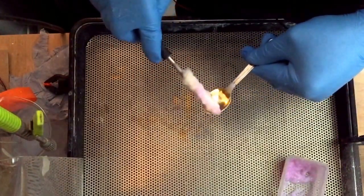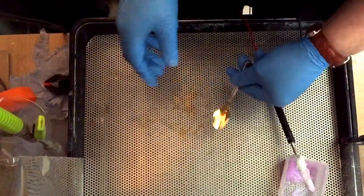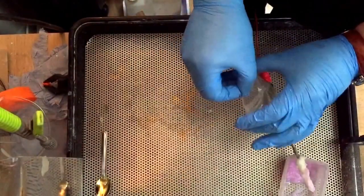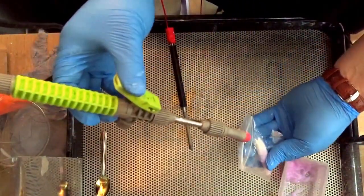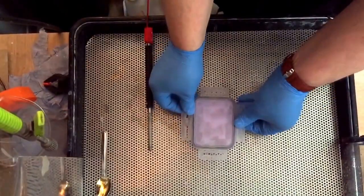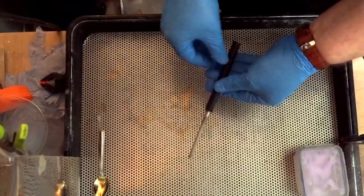I only plate this area to show how it works. If it's a show item you're basically done now. But if the spoon will be used, you need to plate at least 10 to 15 minutes or maybe even longer. There's an online calculator on the Spa Plating website where you can work out the surface area, thickness, and so on. When you finish plating, put the swab in a bag like this with just a touch of deionized water. You can leave it there for weeks and use it again — it'll already be soaked in the solution.